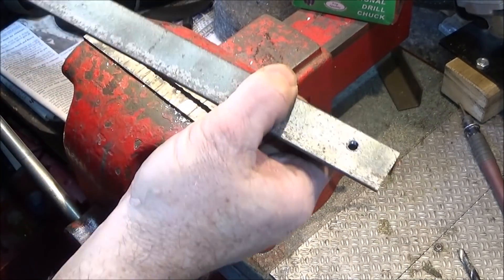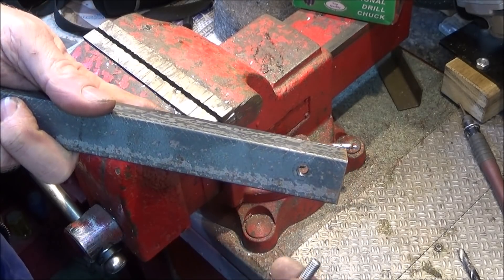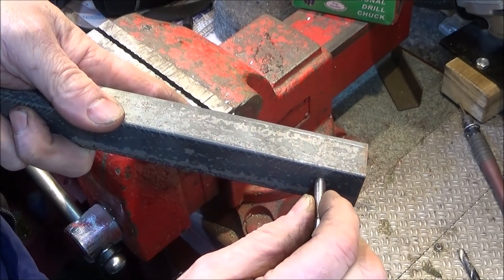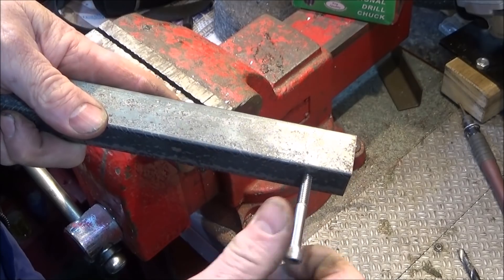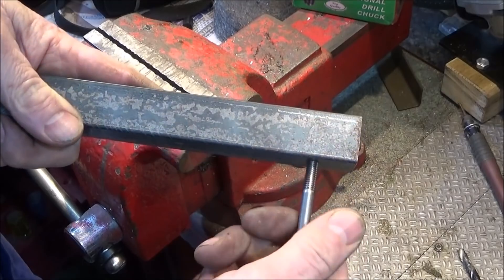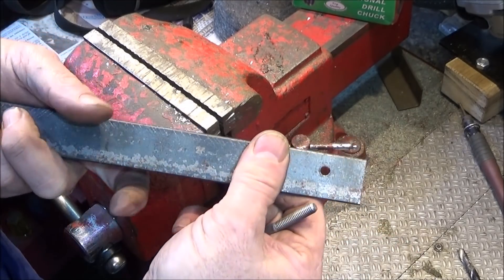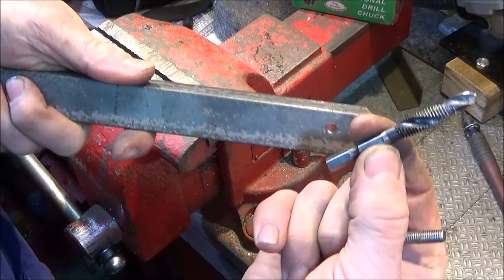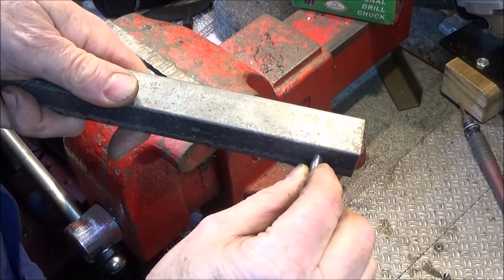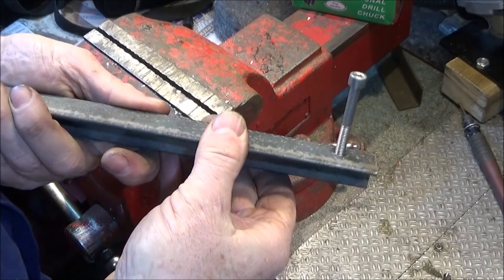When using those drill taps in angle iron or steel it's obviously best to use some form of cutting oil or cutting compound for the thread. But you can see how quick the tool is — it just goes straight through a piece of angle iron and does the thread in one go, saving a lot of time. If you're bolting something together like shelving or whatever, these are great little tools. I'm actually quite pleased at how square I can drill and tap that thread in one go like that.